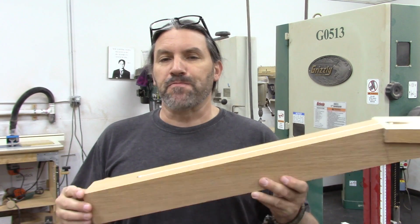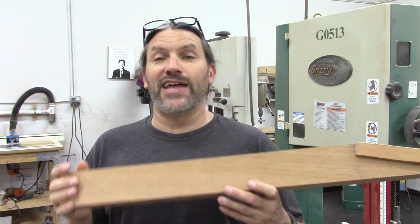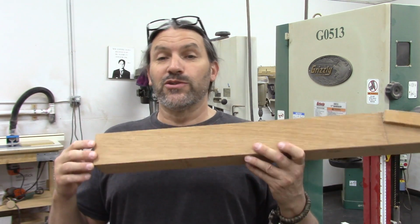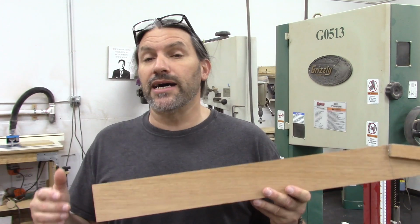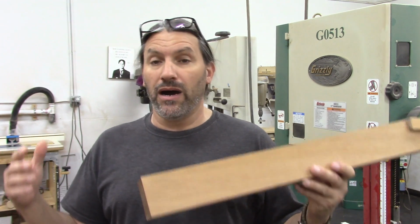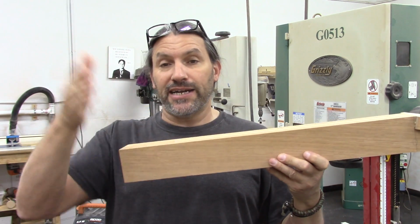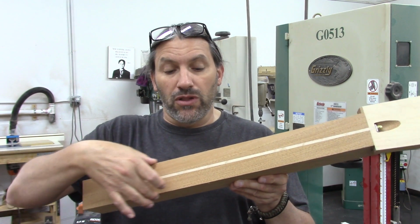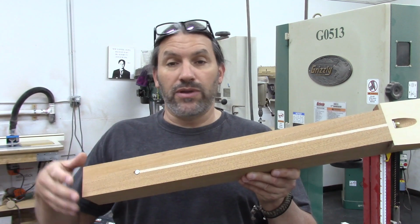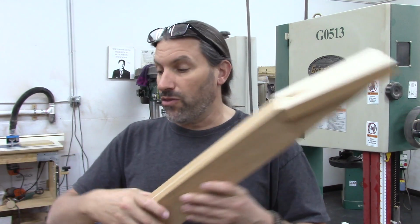So a couple of things. Hardwood is usually sold in quarters. If you want 1 inch of hardwood, that's 4/4, 2 inch is 8/4, 12/4 is 3 inch, etc. So if you were to buy a big chunk of 12/4 mahogany, and it was flat sawn, you could upend it and cut it into slabs and get a bunch of vertically oriented grain that was 12/4. Now it's going to be the full 3 inch all the way down.